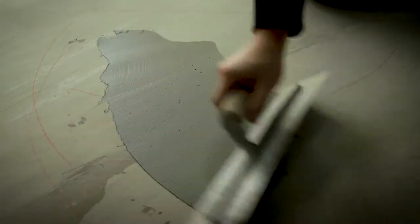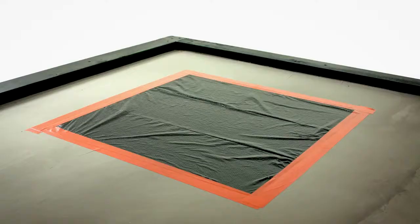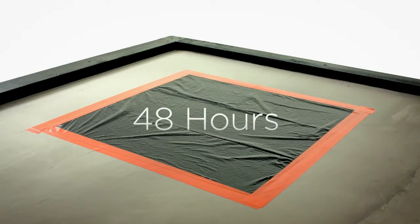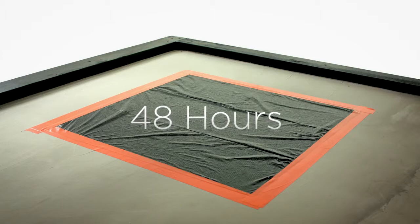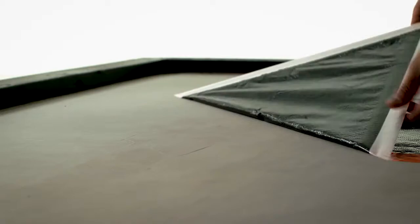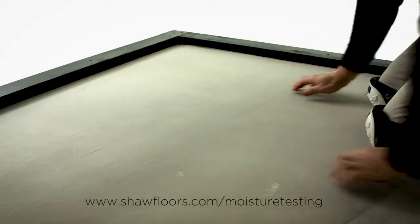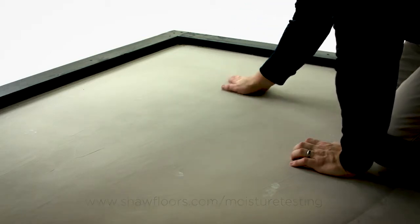If you have concrete subfloors, you can adhere the new tile directly over them as long as they are clean, flat, free from hollows and valleys, and tested for moisture. An easy way to test for moisture is to simply tape a trash bag to the concrete floor along all four sides, creating a seal. After 48 hours, you can check to see if any moisture was captured by the trash bag. If you do think moisture might be a problem, it will be necessary to use a more advanced test. Follow the link below to learn more.